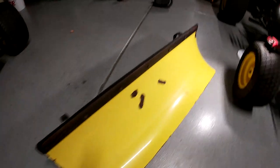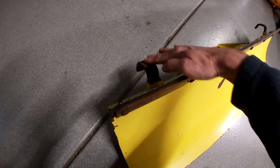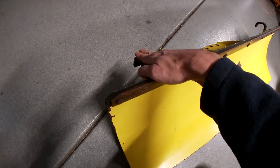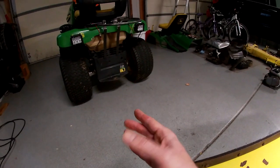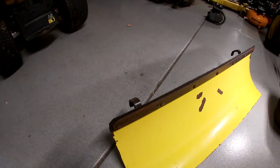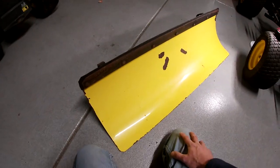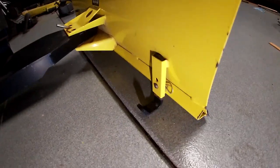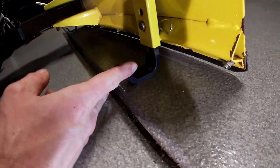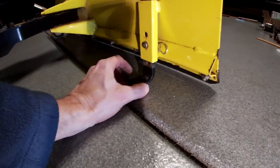This turned out pretty nice all the way down here — I got a chamfer and everything. One thing I forgot about was these feet here. I may have to adjust those when this goes back on. These skids should just touch up against the ground. The X300 has a spring assist in it and it actually lets the blade float a little bit, and it works really well. I don't want all the weight of the blade on these skids — they'll just wear out really fast, same with the edges. So you have to do a bit of adjusting here and there to get it where you want it.